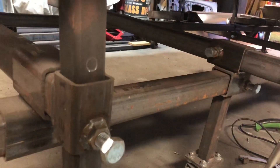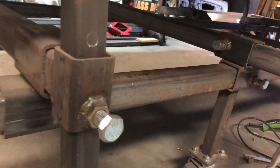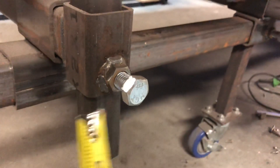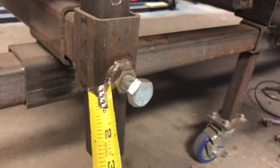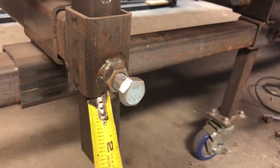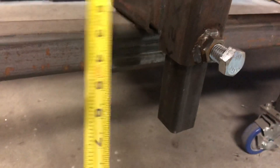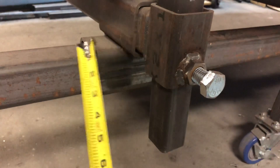These right here are the sliders. You can make it however you want — I made mine fully adjustable in case I ever work on something else. It can be welded once fitted if you want. I use big 3/4-inch nuts and bolts from Tractor Supply. You drill a hole, line up your nut, weld the nut on, and use the 3/4-inch bolt as your locking mechanism — you're going to torque these tight. I didn't make enough sliders originally and had to go back and cut more.